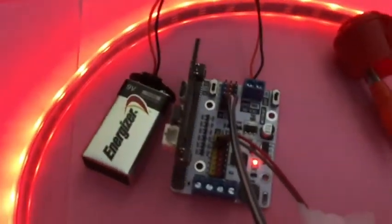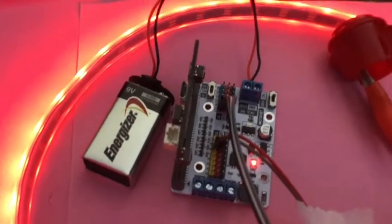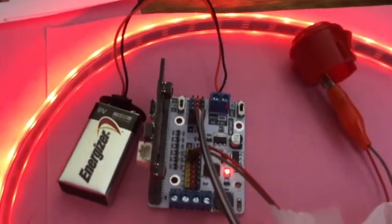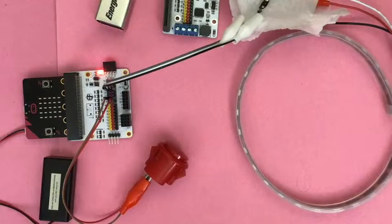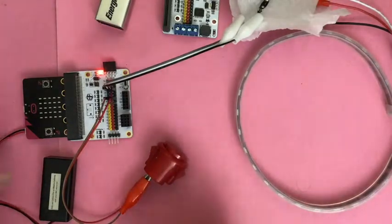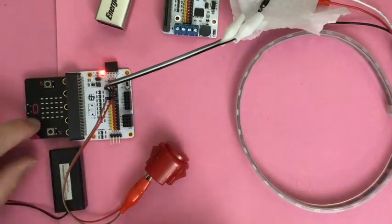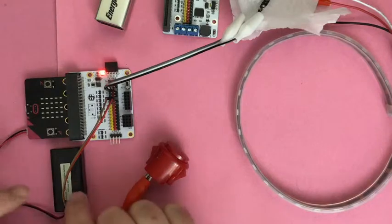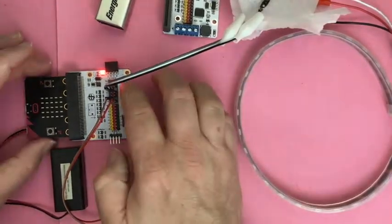So that's the basic hookup for the ElectroFreaks motor bit with some LEDs and a button. Playing around with NeoPixels and a button on the ElectroFreaks breakout board, which is powered through the micro:bit and two AA batteries at three volts. The LEDs can run with three volts, but you can switch to five if you need.